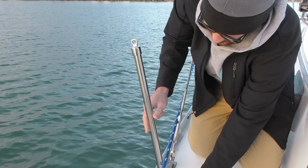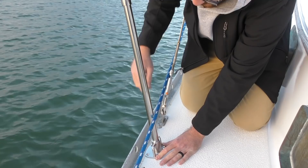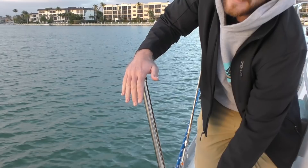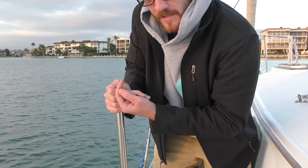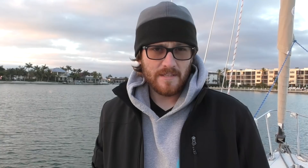This is actually how we're going to mount the stanchions. I believe this is backwards from what people normally do — there's a little bit of an angle to the stanchion base, and we're using that angle to our advantage, making the stanchion point outward from the boat. We'd rather have that than have them pointed straight up, as it gives us more room to walk around. The traditional way would send the stanchion basically straight up and down, but we'd personally rather have them angled a little bit out.